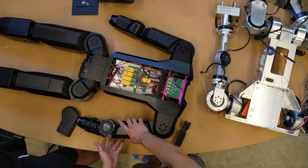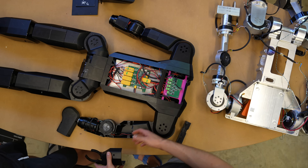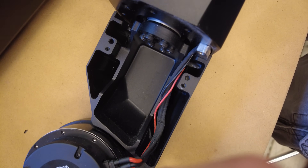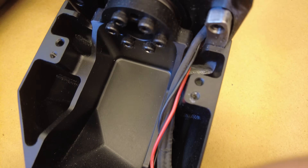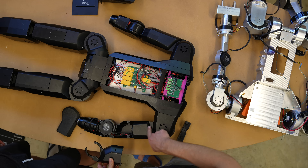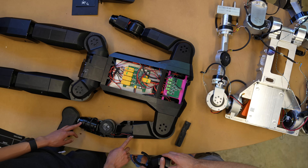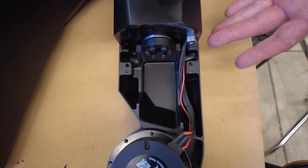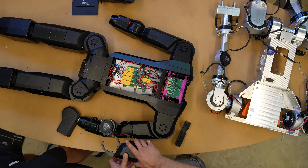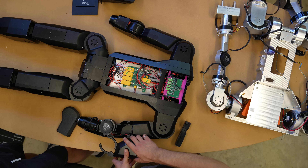Here you can see us taking apart the left arm. I wanted to show off our general clamshell design intent versus a lot of other competitors going for more of a skeleton-with-cover approach. With the clamshell design, we're able to increase structural rigidity, support, and robustness against impacts and falls by building the structure into all of our external-facing components. The wire routing and wiring harness is much easier to access — just open areas with direct lines to the motors. Another benefit is really nice built-in hard stops. Throughout the design iteration process, we've also been optimizing where lightweighting can happen, where we add extra rigidity, and the mass distribution in general.